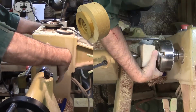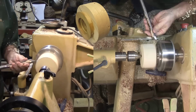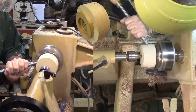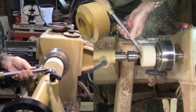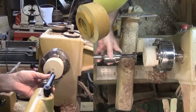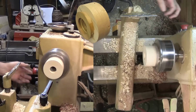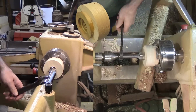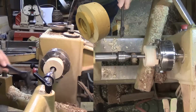I'm making this chuck from a design by Vern Bunn. However, in his example, he mounts his chuck to his chuck jaws in an expansion mode. I prefer not to occupy my chuck with stuff that I don't need to. So I'll mount my chuck to a threaded wood faceplate. I've made enough of these now that the process goes quickly. I start with some 8/4 poplar, round it off. In this case, the faceplate is small enough that it can fit into my chuck with the jaws wide enough to drill and tap the hole.